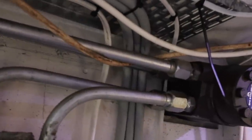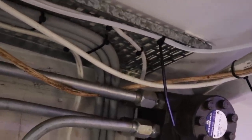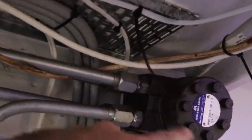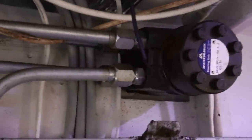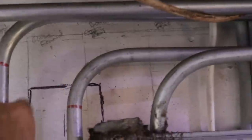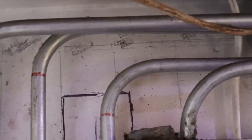Done. Every boat has that one pipe or one piece of wire or one bolt that is just a nightmare to get to. Let me introduce you to Brupeg's version. This is what's called the Orbitrol. It's essentially a hydraulic distribution valve that the steering uses. So the steering wheel is connected to the other end of this gadget here. There's four pipes that come off. This pipe here is right in the way of where we need to drill. So that's a square that's available. We need to drill a hole sort of basically through the center of that.